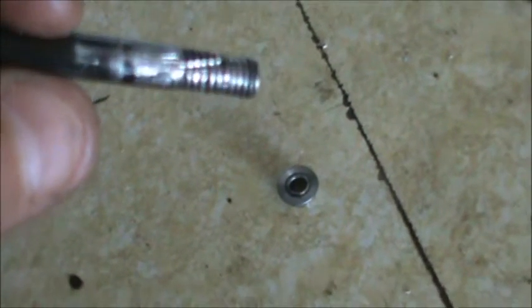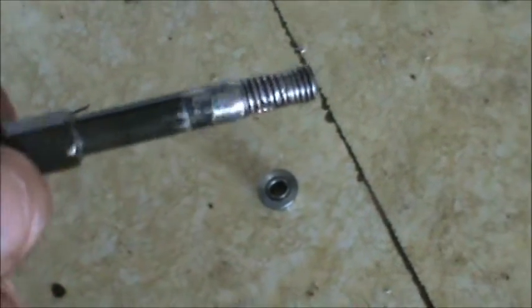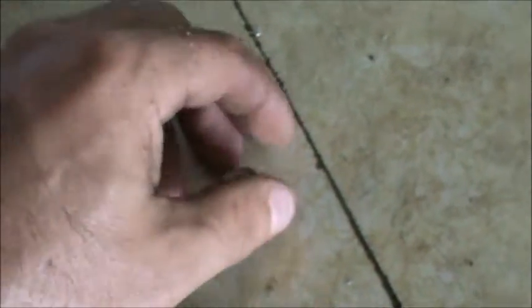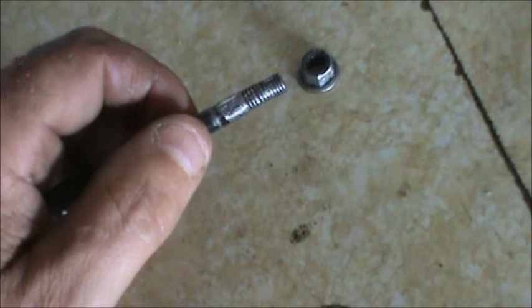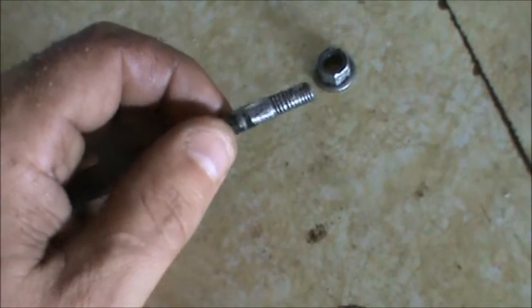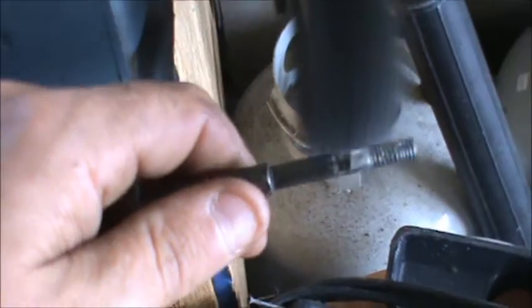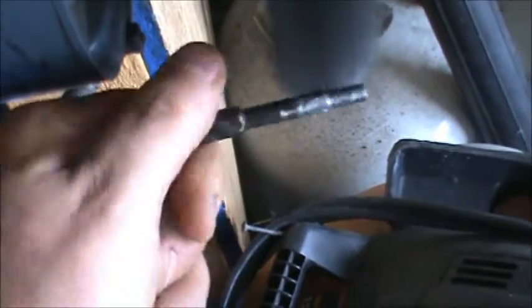He can't use this saw, and he said the parts aren't available — it's like a specialty bolt. So what I'm actually going to try and do is weld on here, then grind it down and re-tap these threads. Right now it's set up for 10 metric, but since my tap is standard or English, I'm going to tap it at 5/16. First step is just cleaning it up, getting all the oils out of there so it'll take a weld — I'm just putting it on the wire brush.